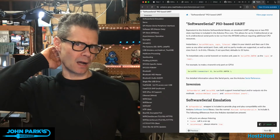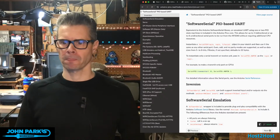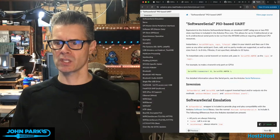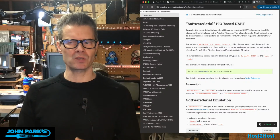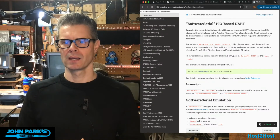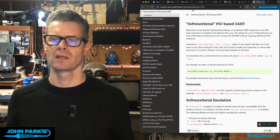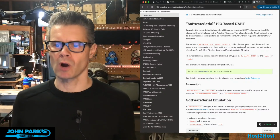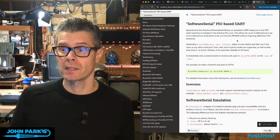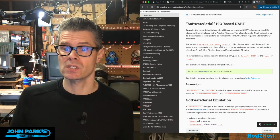So I was going to give up on using that cable, but I think Todd had an inspired thought when he went, wait a second, if you're on an RP2040, all the pins can be part of the whole PIO party, and sure enough, there's this PIO-based UART, and I think this is the question right here.